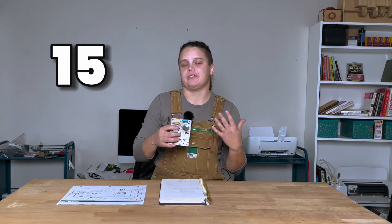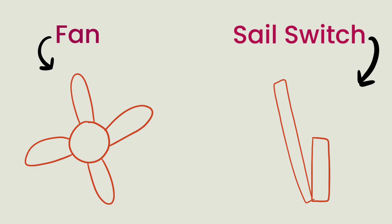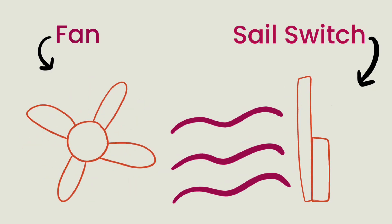Once that fan has run for 15 to 30 seconds, the circuit board is now going to do another round of safety checks before we add propane and gas to the system. This is where that other safety mechanism comes in. The circuit board is going to look for signal through the high temperature limit switch and the sail switch. The high temperature limit switch is what's telling it whether or not the furnace is too hot — it's going to be normally closed and allow signal to go through, but if it gets too hot it will open up and shut everything down. The sail switch on the other hand is normally open, but once the fan turns on, the air coming from the fan is going to push down on that paddle of the switch and close it, allowing signal to go through.